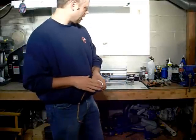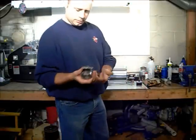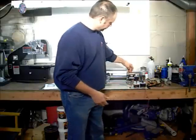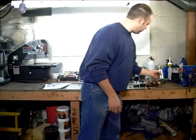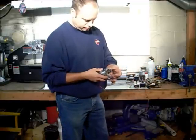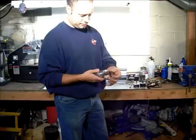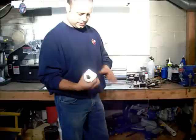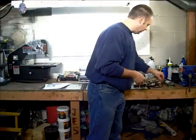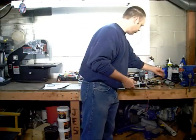I have a couple of these stepper motors — one, two, and there's one here which makes three. I do not think this is a stepper motor with a very large motor inside the printer. You can feel a stepper motor generally when you twist them, and this one's not giving any kind of steps, so I think this is just a run motor. It may come in handy for something. There are also a lot of little stepper motors, little bitty ones, and those are nice.